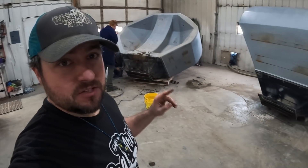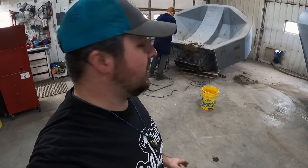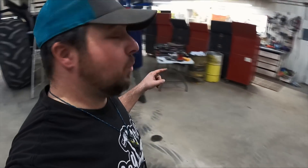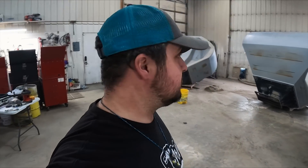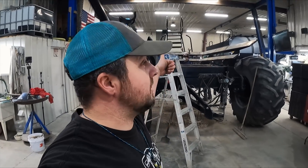What needs to be done is each one of these plastic tanks has a cradle on the bottom — basically a belly pan — and they've got bolts through them. The bolts are so rusted out you can't get them off, so they're taking the plasma cutter and cutting off each one of the bolts to remove the pan. When they install the new stainless steel pans, we'll put those in the cart first, then put each tank in and bolt them up. It was much easier to remove the pans and tanks all in one.